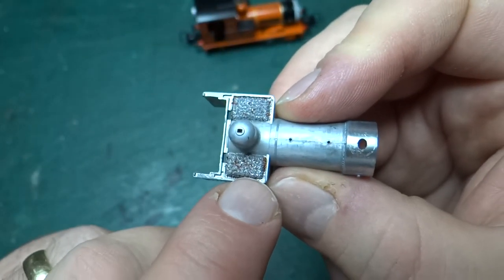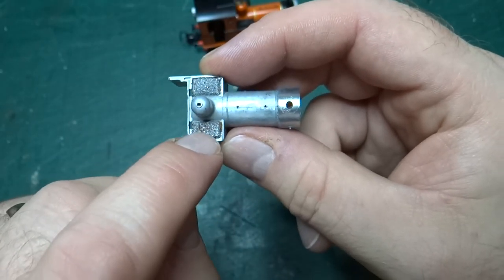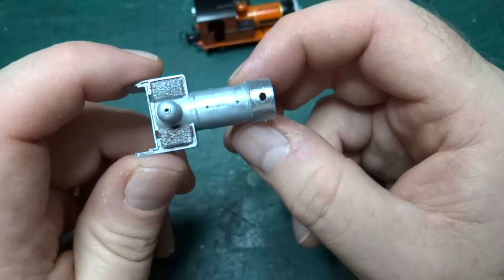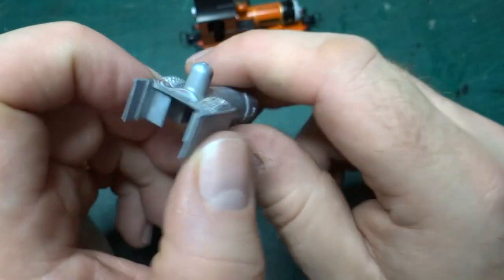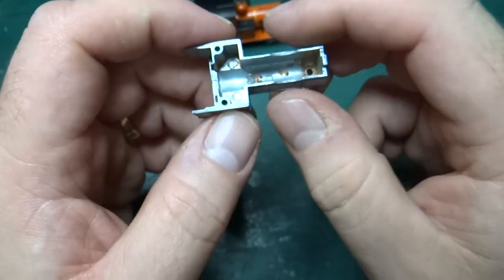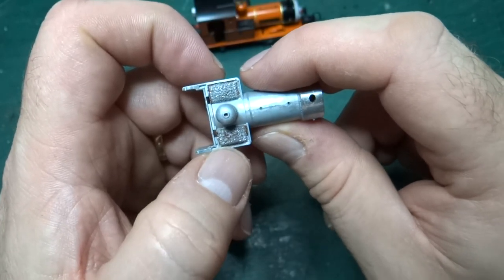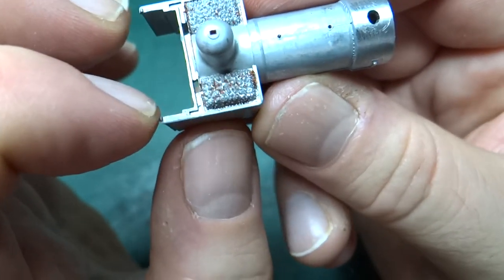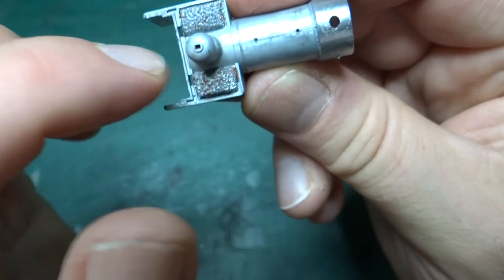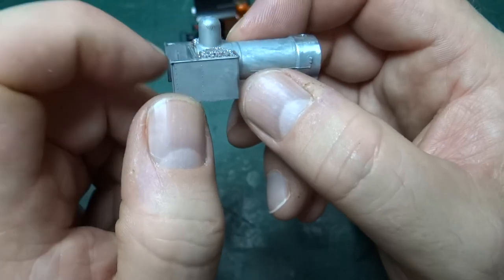On Skarloey I had to set up the lathe — a Unimat 3 with the milling column — set up as a mill and milled off the top. The advantage was a nice smooth flat surface, but getting Skarloey's body held tight in the lathe was a pain. This one might not be too bad because I've got a nice straight section I can grip in the machine vice. The problem is I don't want to grip it too tight and flex it if this is a softer casting. I'm not sure yet whether I'll file this off or mill it out. The problem with filing is I don't want to damage the lip around the edge, so I'd have to bring the file in from one side only and not catch the dome. The mill may be an easier option, although I still have to make sure I don't catch the dome with the end cutter.